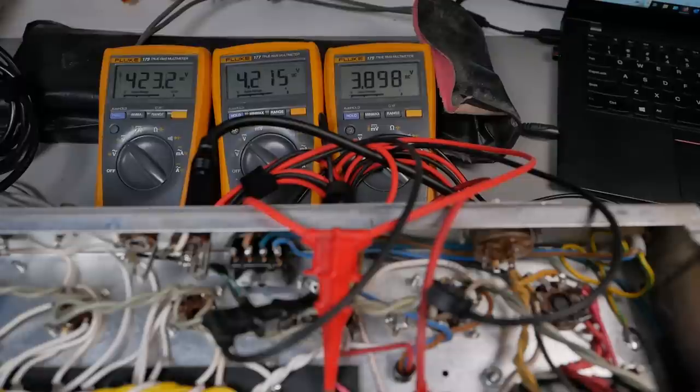There's a pop. We're sitting around 100% there. And that's at 220 volts input on the mains. So when we're at 240, 250, it's gonna be a bit hot. So I'll dial back that bias by changing the resistor to ground in the bias circuit and try again.